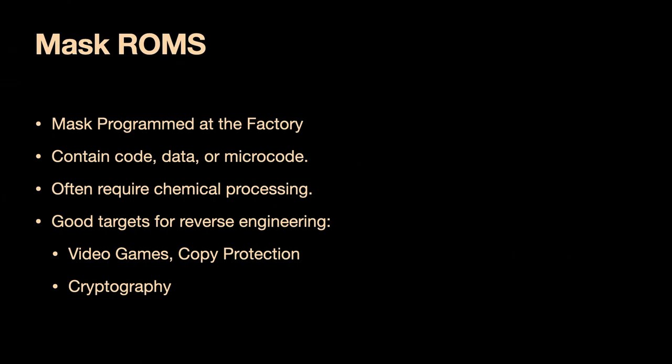In the case of this chip, I think they did it as a mask ROM in order to make the card harder to reverse engineer. You could read some of this card out by taking the external memory chips over to a new board and reading them like anything else with an EEPROM programmer. But for the internal memory, you can't do that. There are no documented debugging pins, no JTAG in that generation. So photography became the most expedient way for me to read this.